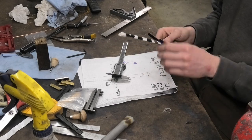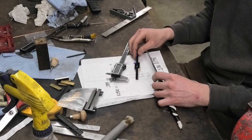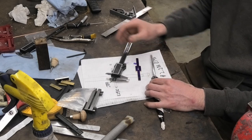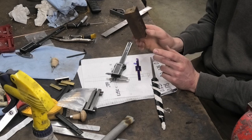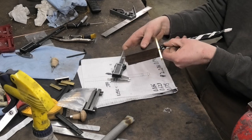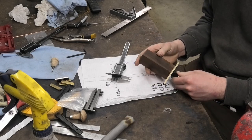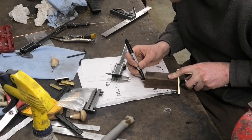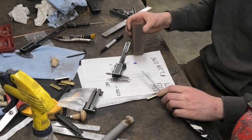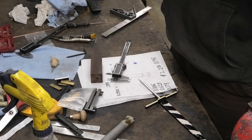All looks really good. I think what I should do now, just because I don't want to be working on one piece for too long because that gets really boring, is bed the tang on this handle block. I could cut the tang down now, which I think is what I want to do. I'm just gonna cut off that little bit of metal poking out and then put a piece of painter's tape on this side to plug that hole so the epoxy doesn't spill out.